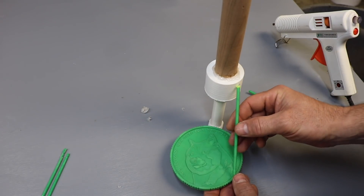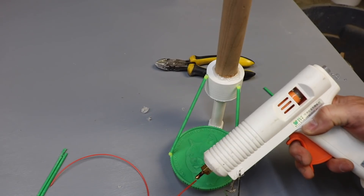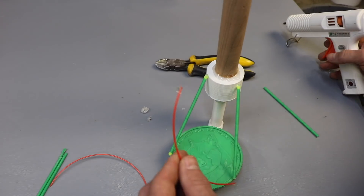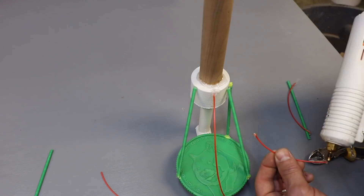These are vents, and the larger ones are to help support it while I'm building up the ceramic shell. I use some straight PLA filament for some smaller vents. I want plenty of vents to make sure that the mold completely fills when it's poured.